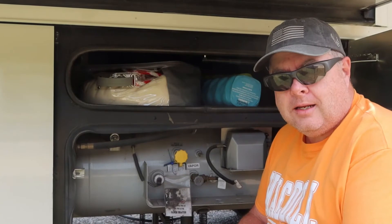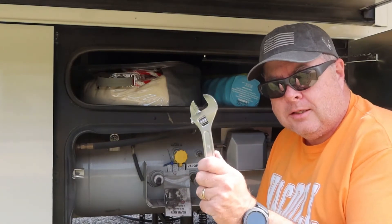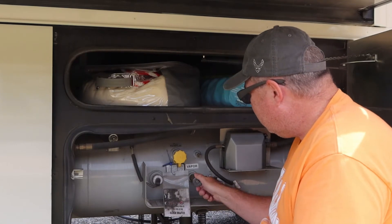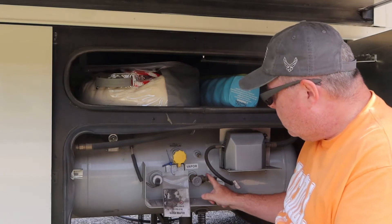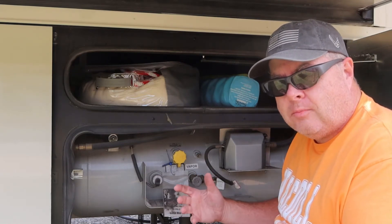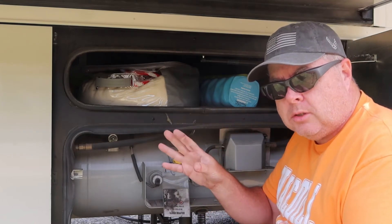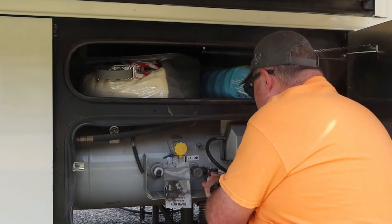Okay, so now we're at the propane tank — let's get this job done. It does not require any tools except an adjustable wrench. The very first thing you want to do is make sure that the propane tank is off, so we're going to turn it off. And that is off. Now we're going to disconnect this hose. When you disconnect it, you may get a little bit of propane come out quickly — that's what's in the lines, so don't worry about it as long as it's just a quick release. And you can hear — yep, we got a little bit of propane come out, and that was it.